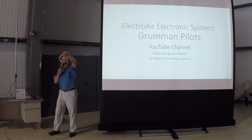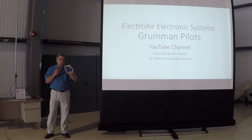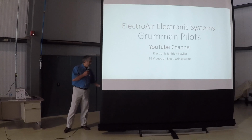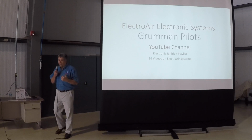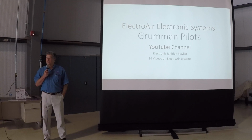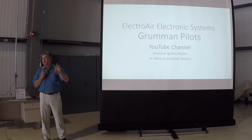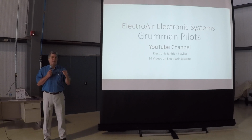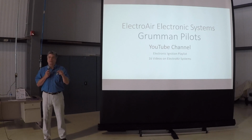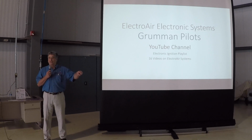It looks like this. Everything's banded together, just clicks together. So once we do the firewall side, then we're ready to go into the cabin. And there's a couple things we have to do in the cabin. We need a 10 amp circuit, whether it's 12 or 24 volts, to drive the coil pack. That's wired to the master, so as soon as the master's on, the coil pack is energized. And then you also have the controller box itself, which takes 2 amps, and they have to be on separate circuits. They can't be daisy chained together.